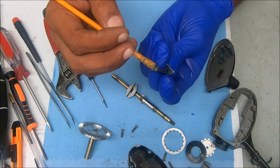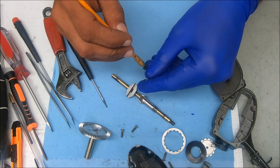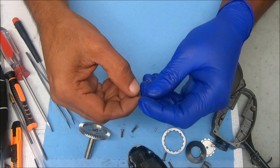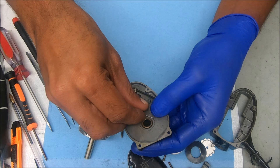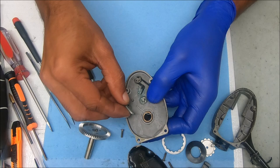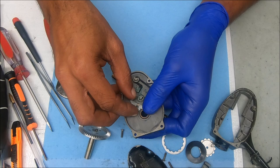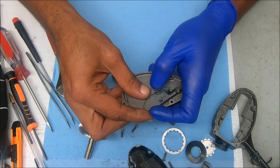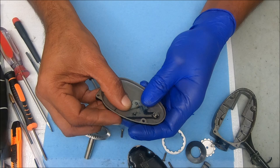All right, so to stick this dog back on, you can sort of do it now. Take that pointed end or bent end, put it on like that through the hole. Then put that ring end around that post right there. I'm just going to set it on like this. I'm going to lift up. I'm going to kind of push it over as I tilt that dog slightly. Just like that. And then I'm going to push with both hands over and then kind of rotate that dog in place. Just like that.